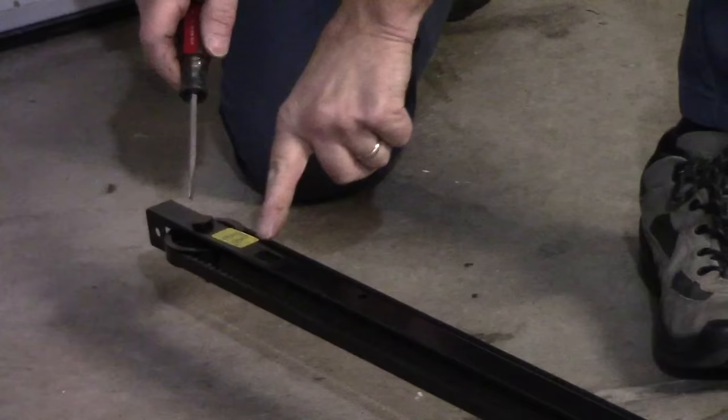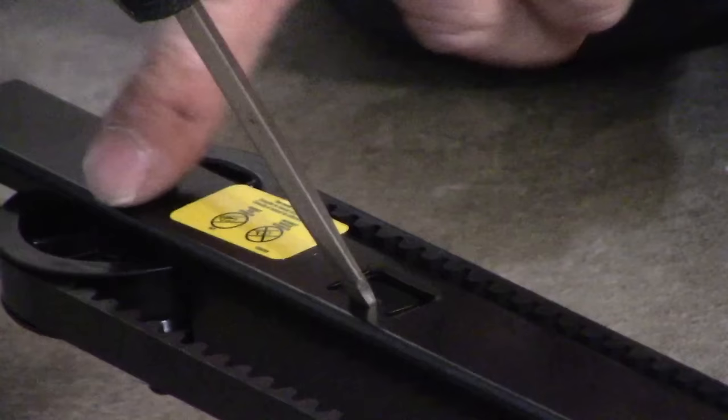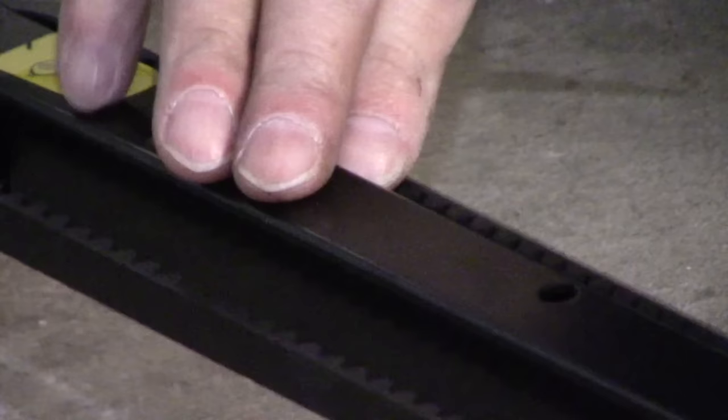All right, then what we're gonna do is we're gonna come up over here, and this piece here is a safety. So that way the garage door opener doesn't open too far and wind up damaging this over here. So you just take this and you bend it down like this. And now that keeps the trolley from going too far past there. All right, so that's finished here.